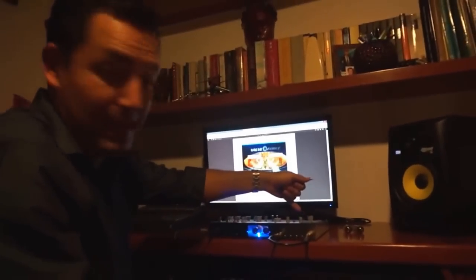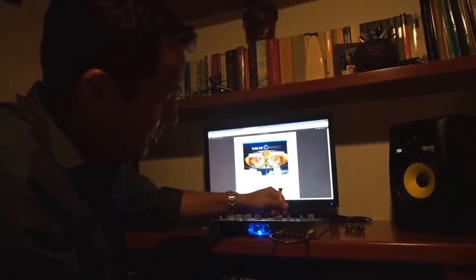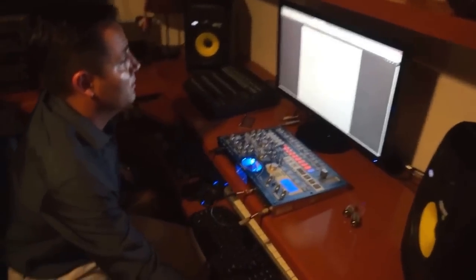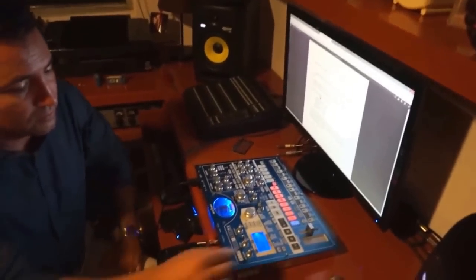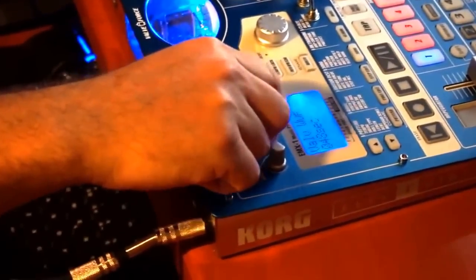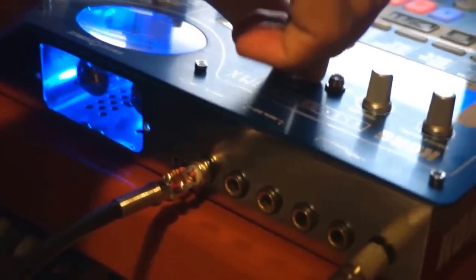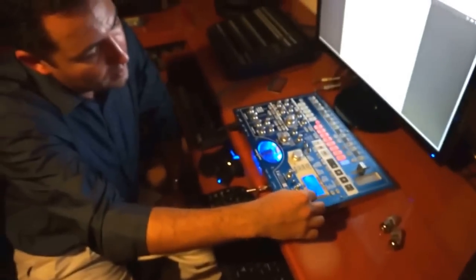Important recommendations: if the reading that you get in the next step is way too big, it's because you're using the wrong type of resistors, there is a short circuit, or you haven't unplugged the audio cables. You need to set master volume all the way up, tube gain down to minimum, audio in level to max, and this switch has to go to mic.